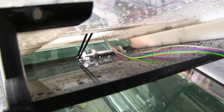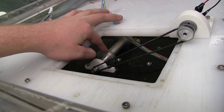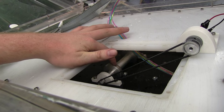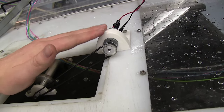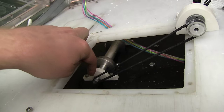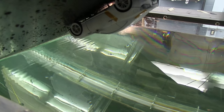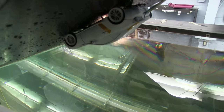What you do is make a mirror image of the wheels — you can see that here, and we'll look at it in more detail from the top. Essentially this is a mirror image of the wheels, and the wheels are touching them. We spin this instead of actually spinning the wheels on the model. We do that with a pulley-mounted DC motor which is out of the water — the DC motor turns one pulley, which turns another pulley, which turns the shaft. Because the wheels on the model are in contact, you can see that they are rotating.